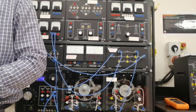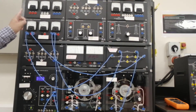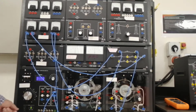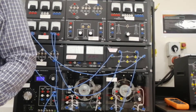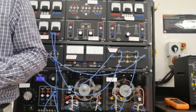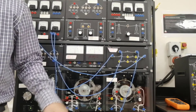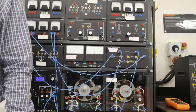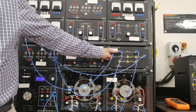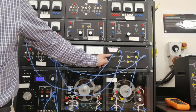Note the deflection of the DC voltmeter at the moment you close the power supply. When you switch it on, check the needle. If the voltmeter pointer momentarily deflects to the right, then terminals 1 and 3 have the same polarity mark — terminal 1 is connected to the positive side of the DC power supply, and terminal 3 is connected to the positive side of the voltmeter.